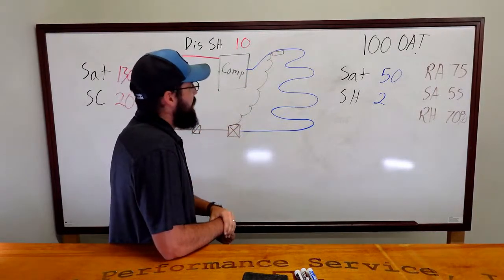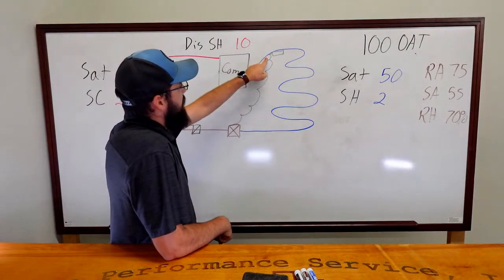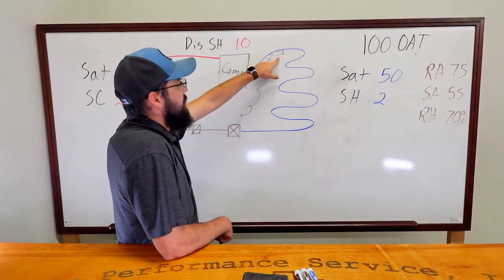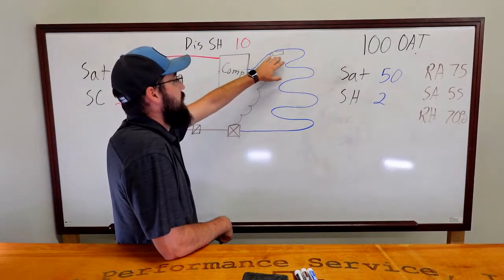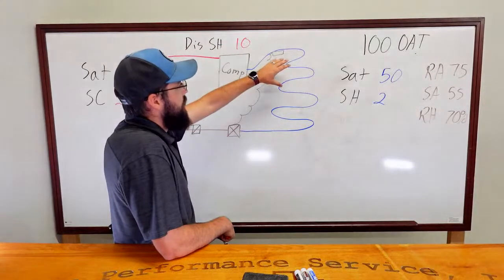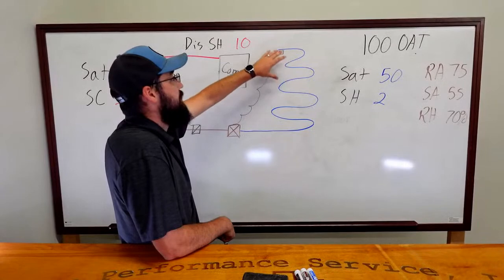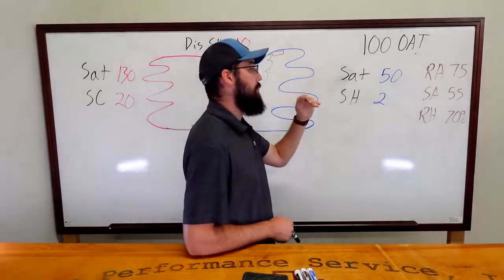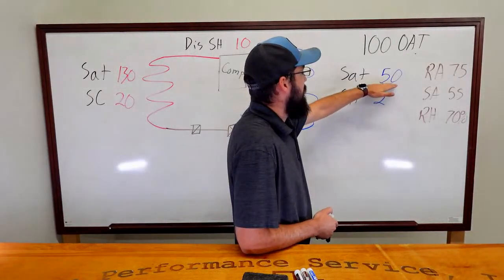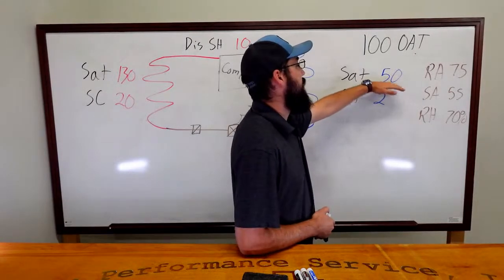Let's say the bulb wasn't attached then. The other side of that factor would be, okay, then I would be overfeeding because I'm reading air, which is 55. Well, okay, so I can talk myself out of this one. I'm reading, say, 55 here because this is going to give or take read supply air. So let's say this bulb thinks it's seeing 55 to 60 degrees once you actually calculate the mixed air. So it's trying to maintain 10. It could be thinking it's sitting somewhere around that spot. So ultimately it's going to feed heavier because it's not measuring the suction line properly. So because the valve isn't reading properly, it's not taking a proper pipe temp, then yes, these two readings could make sense because we're showing we're overfeeding. We're not maintaining low enough superheat because it can't read the pipe right. And we've got a whole lot of refrigerant in that coil forcing our saturation up.